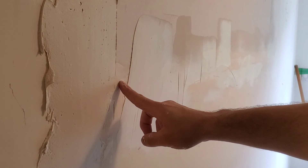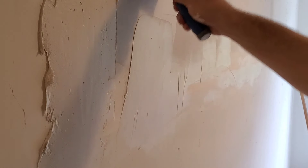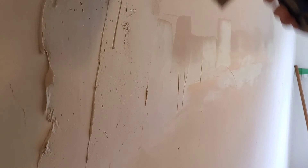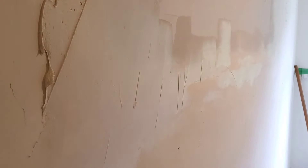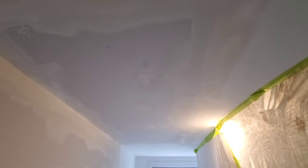So this here is going to be the deepest part, so I'm going to start farther out. This is a low point, this is a high side, so I'm going to start further and come all the way across. Once again, you want everything encased in mud. There's a small patch and then this is the bigger one — I should have gone a little bit thicker. But it's better to just go back over after everything is dry instead of trying to fix something, because you may just mangle it. This is my second coat overall — tape was the very first one. I'm going to set up a heater and a fan to dry this out. Up to this point, this has been an hour total.